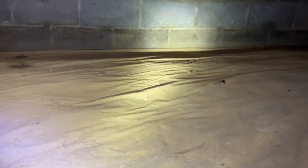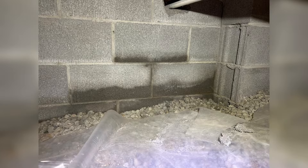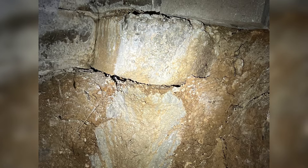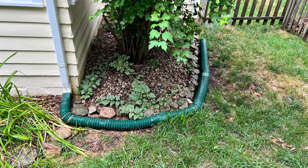You can see this is where we've got water which floods into the crawl space and then recedes. You can see the soil on top of the plastic and the soil line at the foundation wall itself. Here's a sign of water coming through the foundation, and here's a sign of water coming underneath the footing — they actually tried to redirect it. Here's water coming through the foundation. All of this is because someone couldn't put an extension on the downspout in order to get the water five, six, or ten feet out into the yard.